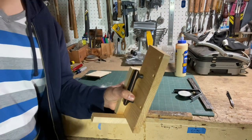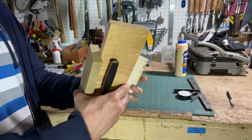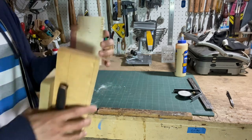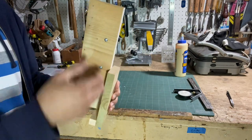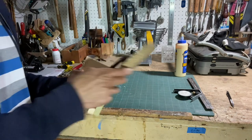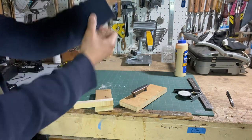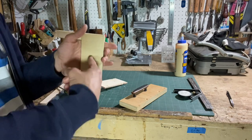I have the one-inch mark drawn here, then three and a quarter and six and a quarter inch measurements — you can see where they intersect, and I drilled these two holes out. After this, I put this block perpendicular and stuck one of the drawer handles on to show it works for both right-side and left-side doors. I can butt it up on the bottom to drill the holes, and for a left-facing door I just do it from the other side — same measurements from both sides. Let me put proof to practice with this handle jig.